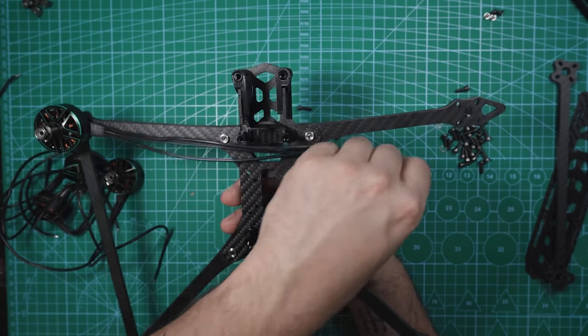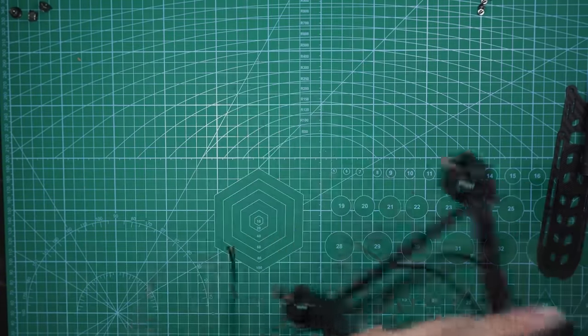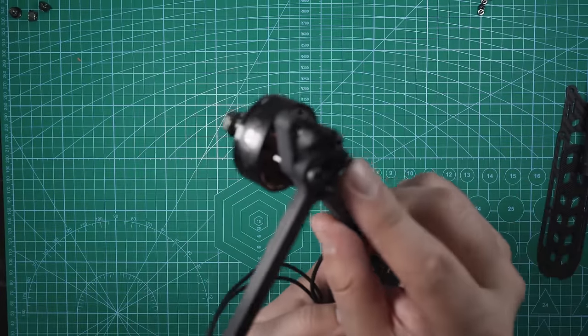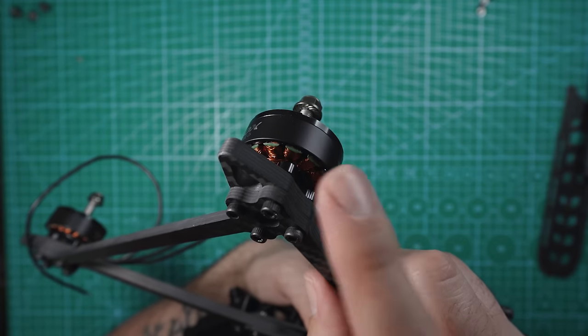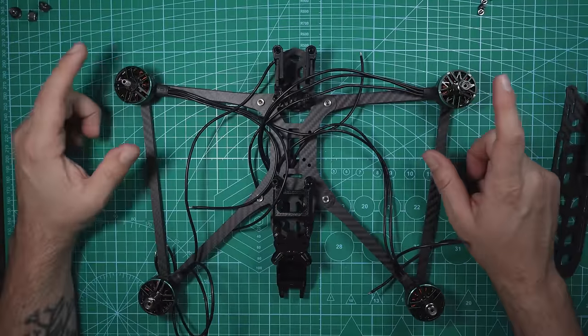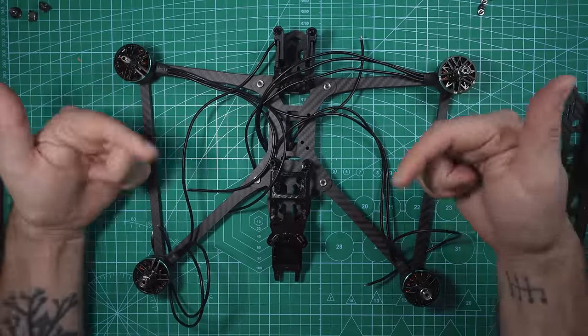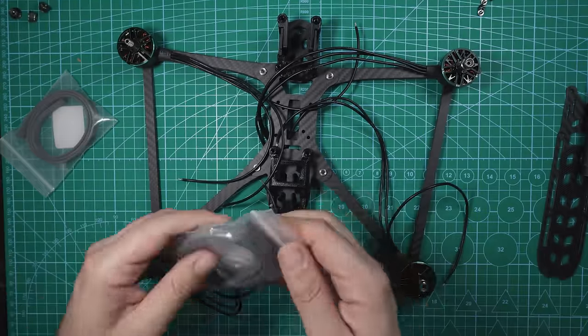So running the wires along the arms, let's do that for each arm. All right, so we got our motors on. I mainly used M3 by 12 screws. If you use M3 by 14, just make sure that the screw isn't going up into the motor, otherwise you're gonna have problems. I will leave a link to some M3 by 12 screws for this build down in the description. So let's put these on the wires just to kind of clean this up a little bit.